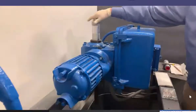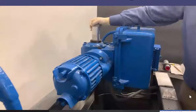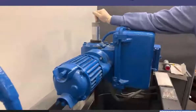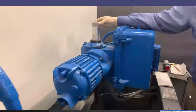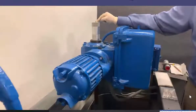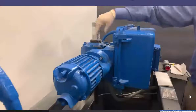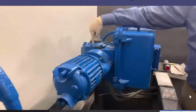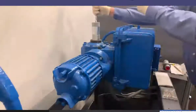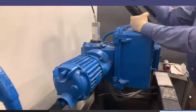This is custom built to the correct dimensions because it has to be narrow enough to fit inside the stem nut lock nut. Now I've got that o-ring threaded down on top, creating a chamber which connects to this zerk fitting on top. The grease zerk fitting is going to allow grease pressure to build, go down, engage the top of the nut, and because of that seal, force the grease down through the threads. I just take a grease gun and pump grease down in.